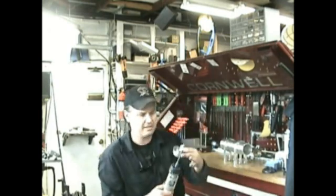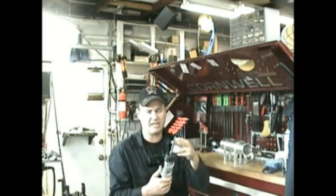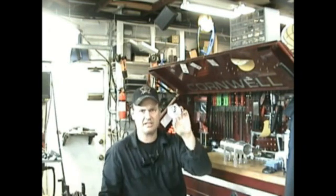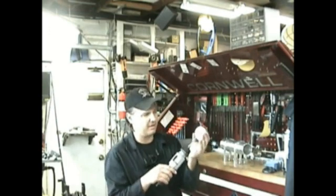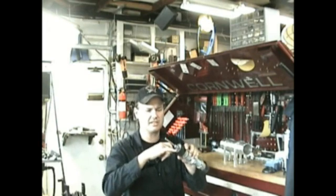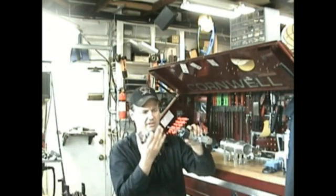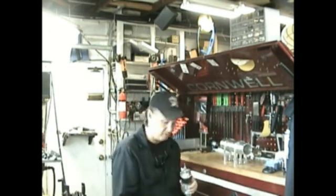This is just the shaft that rotates the wheel. There is actually no weight sitting on top of that because the weight is sitting on this hub. The shaft, as you can see, has a bearing inside — which is most likely rather unnecessary — but the shaft goes through there like this. The ring on the inside sits just inside here, adds a little extra support for the end. Not as if there's any load there, but it does center it.